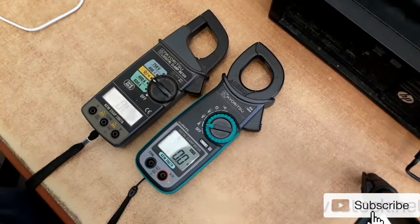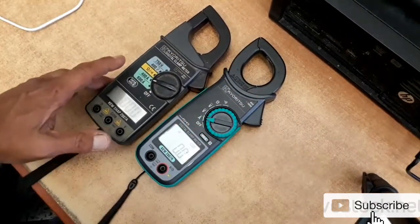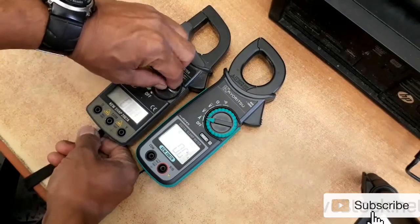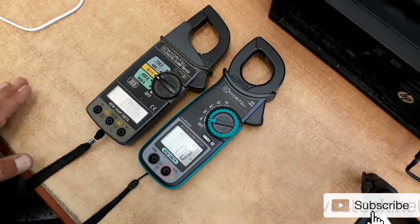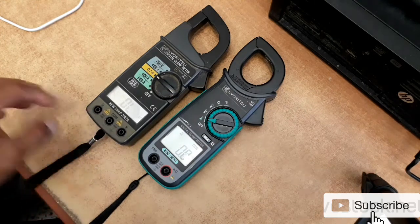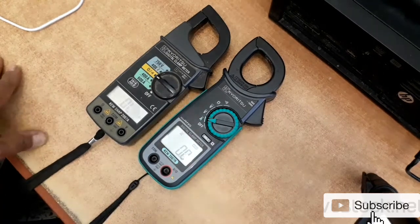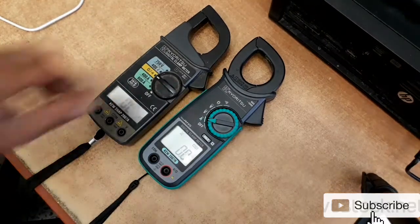Let's compare my old one and my new one. The old one has a selector for 400 amperes and 600 amperes, while the new one has auto-ranging up to 1000 amperes. On the new one, moving the selector puts us on the ammeter range, while on the old one it's in a different location. The old one has three terminals for the test leads — common, voltage, and ohmmeter — while the new one has only two: common and a combined voltmeter/ohmmeter terminal. Also, the old one doesn't have a DC voltmeter, while the new one does.